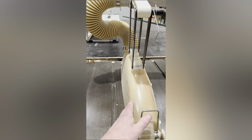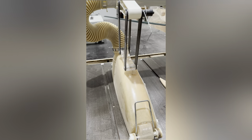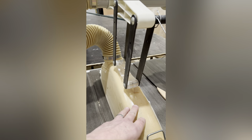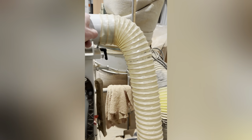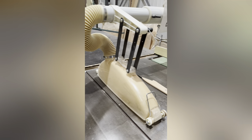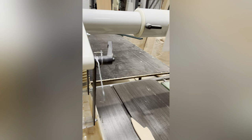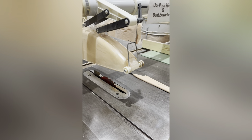This plastic piece here is called a crown guard, which covers the blade. In the UK you are supposed to have some sort of dust extraction on them — these laws will probably vary for different countries, but in the UK they say you need a crown guard and it has to have some extraction system fitted. This one goes up this pipe, across this steel tube, and then into a pipe and up into the extractor at the side of the saw. When you're cutting things like MDF you really want that on to keep your dust down. I've made this handy clip here from a paper clip — it lets you lift the guard up when you're changing the blade or setting the guide, so it's out of your way.